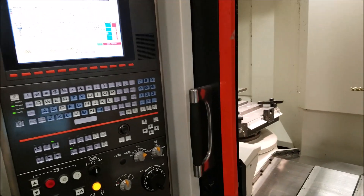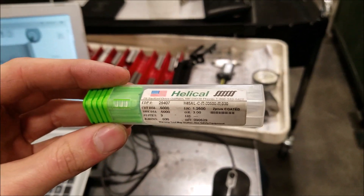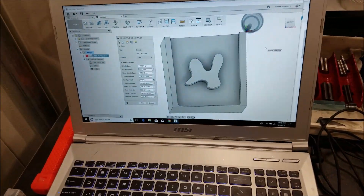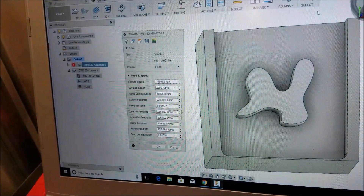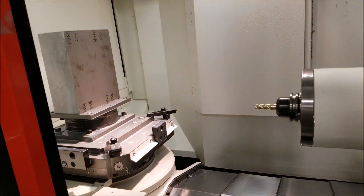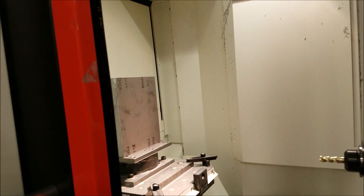What I'm going to do today is test out a helical half-inch roughing aluminum end mill on this block. Half-inch end mill, one-inch 250 length of cut with the coating. I'm doing exactly what their book recommends: 2200 surface footage, four and a half thou per tooth, and 200 thousandths width of cut. I have not run this program yet, so we're gonna see how it goes — 16,807 RPMs. Let's test her out.